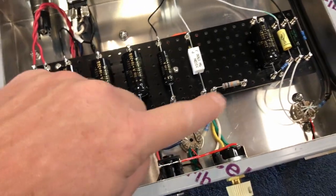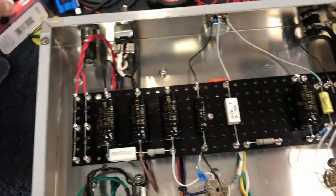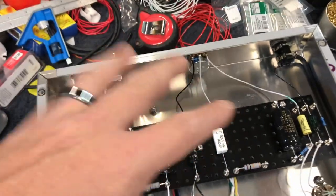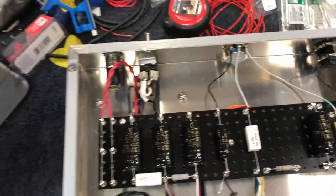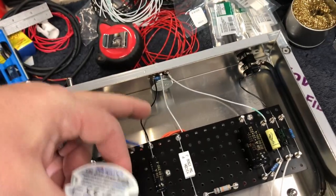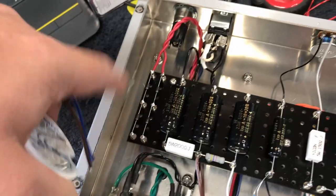I also have not tacked in the pilot light yet, so that's going to get tacked in next. One of my things is I put LED lights inside of the cabinet - there are lights inside the cabinet and you'll see in pictures later. I use these LED drivers. Well, these LED drivers are obviously too big to fit in this amp. Maybe I could put it right there, but I don't really want it sitting right next to my signal lines. It's too big to fit over here. So I have another one on order that should fit in that area over there.